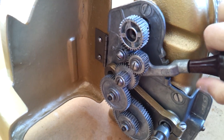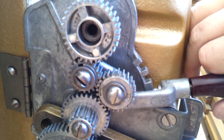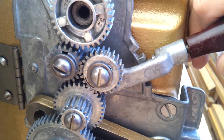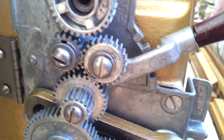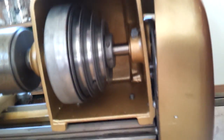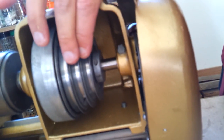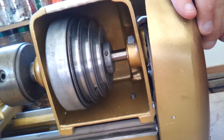Shifting forward and reverse — you can see how the gears mesh. On the back of the lathe there is a planetary gear reduction right here, along with multiple pulleys. I plan to put on a countershaft to slow this machine way down.